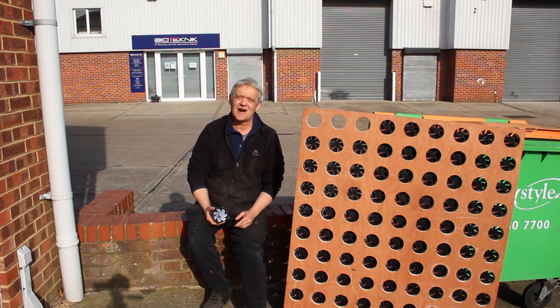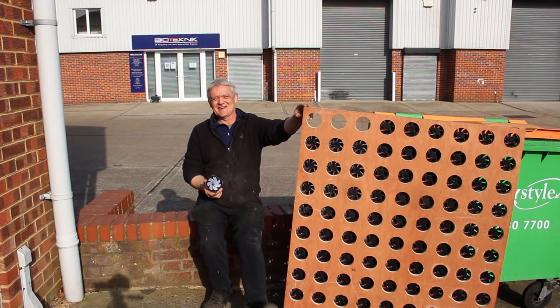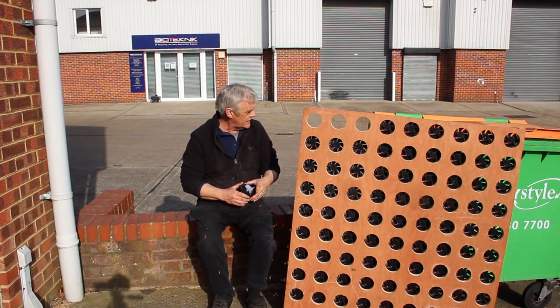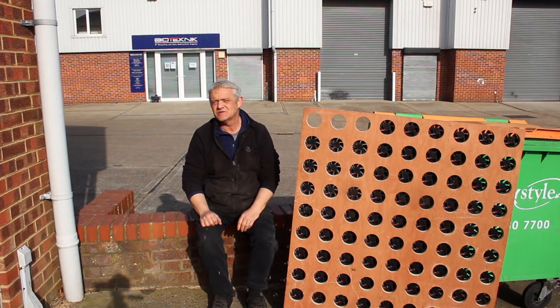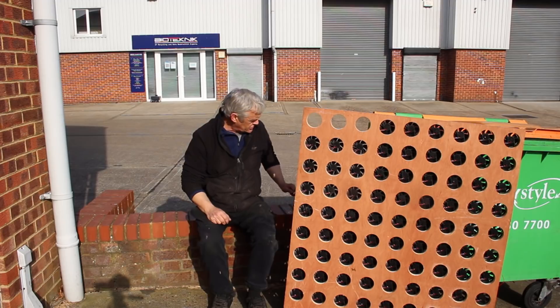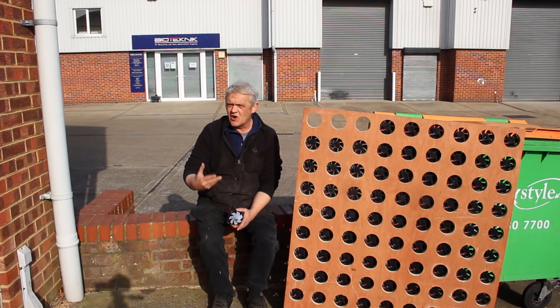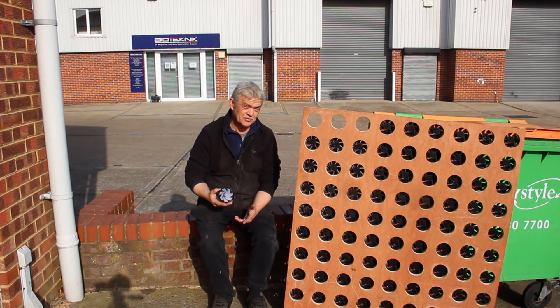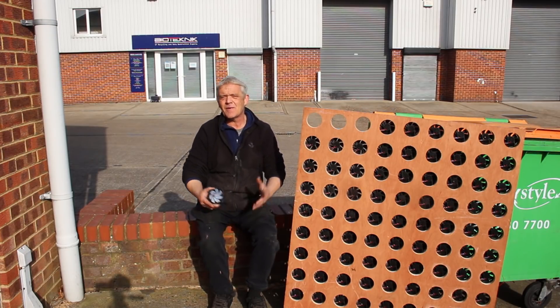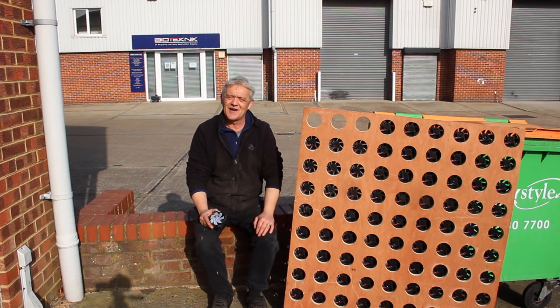So all I've got to do now is make 100 more of these. That's how I'm going to scale up this wind turbine into a wind wall — making those tiny ones and attaching them to the PC fan hubs, because in there the brushless DC motor has a conversion efficiency of roundabout 80%, making it a pretty efficient conversion system on a pretty efficient turbine blade. I hope you're enjoying the video series — please remember to like and subscribe.